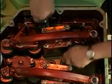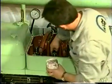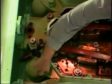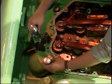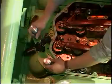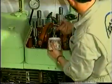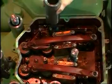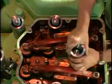Remove the protective caps from the cylinder head studs. Clean the threads and grease with Molykote or a similar product. Mount the extension tools and grease the threads. Mount the spacers in such a way that the Tommy bar can be applied through the slots when the nuts are to be loosened.